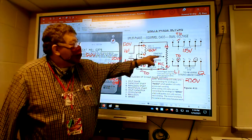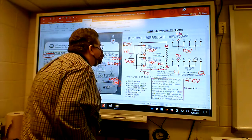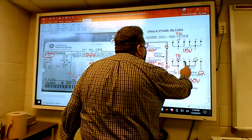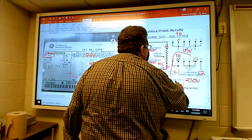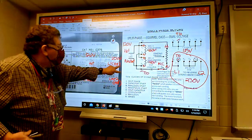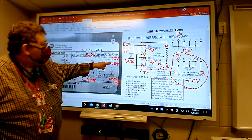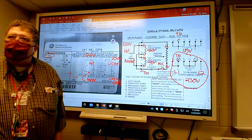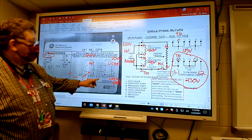Now let's change the scenario. Say you're on a hog farm or turkey farm and they're running everything at 230 volts. We're going to go with the other diagram. We're bringing in two hot wires and when you measure voltage across those it's going to say 230.